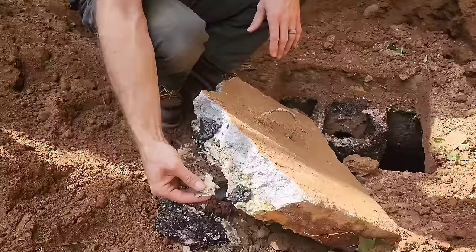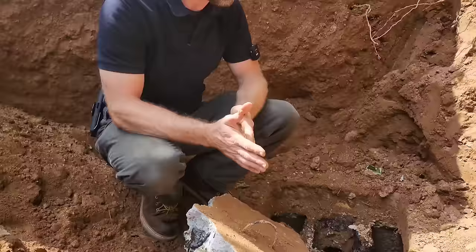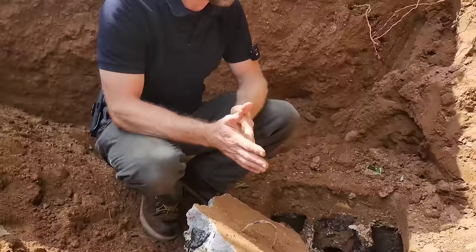First things first — the lid, when we went to pull it out, just broke off in our hand and you can see it's deteriorated. This is supposed to be concrete but it's not — it's just soft, sort of like the consistency of butter. Literally the tank is deteriorating and getting weaker each passing year because it hasn't been serviced the right way.